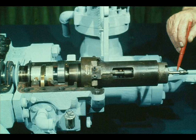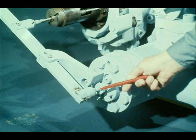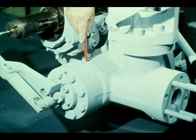The workman is now pointing to the spindle, which is pushed out or pulled in by the weights. Looking from the other side of the turbine, you see that the spindle is connected to the governor lever. The lever is pinned in the fulcrum bracket in the center, which allows the lever to pivot one way or the other. The opposite end of the governor lever is pinned to the governor valve stem. This part of the casing encloses the constant speed governor valve. The valve inside opens or closes, regulating the amount of steam admitted to the turbine. The position of the valve is determined by the action of the constant speed governor, transmitted through the governor linkage — made up of the spindle, governor arm, and valve stem.